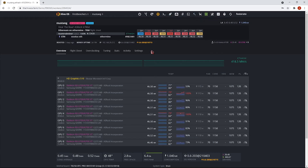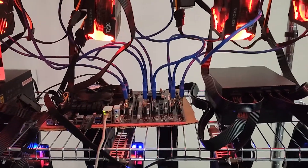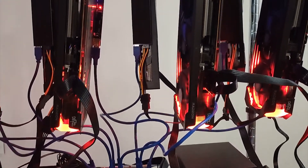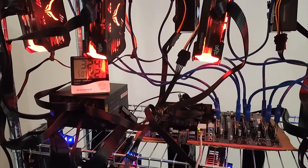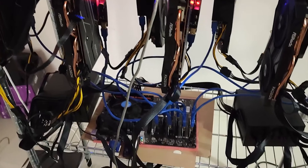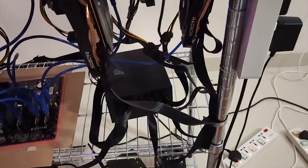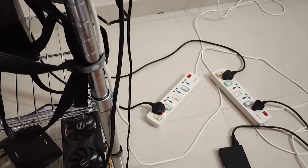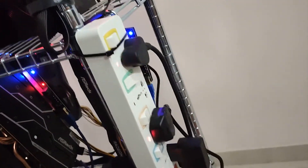This is the rig we built — it took a lot of time due to power supply issues. We had an issue with the 16-amp power supply. Each rig needs six plus six amperes of supply. For each SMPS we used one particular spike connected with the six-ampere supply.